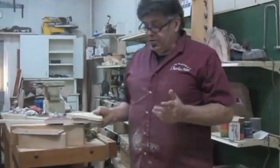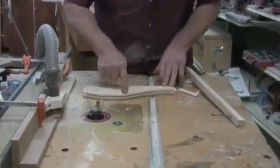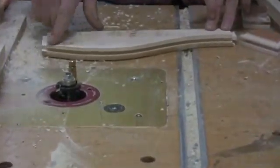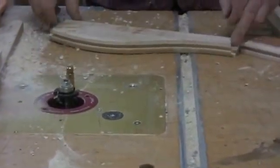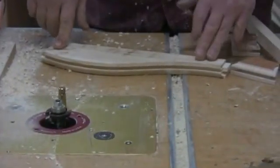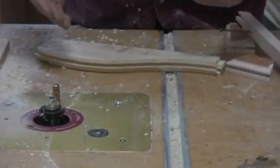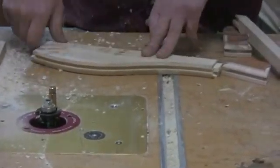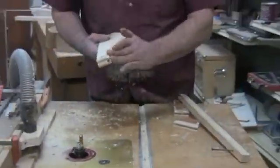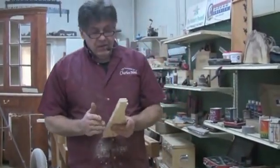And just to make sure you understood what I just told you, if you had, let's say you bandsaw this, say a 1/16 or an 1/8 of an inch from your line, now you would go back and either sand it to the line or have a pattern made that you could use like our spiral bit or something and router cut it to the line, then run it again if you're having a tear out issue. Okay? Now, the same thing applies.